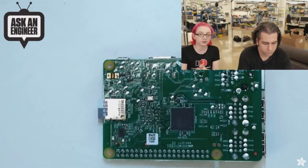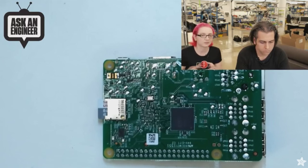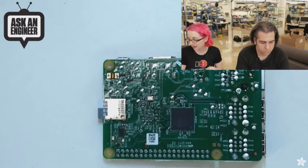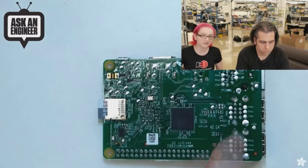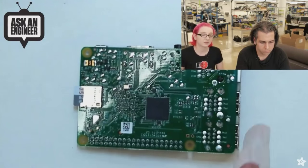It can do Bluetooth Low Energy. It can definitely do Wi-Fi, because I booted up, associated with the Wi-Fi, and loaded up Adafruit. I believe it also has Bluetooth Classic, because Matt Richardson posted a video of it doing audio. I think it can do Bluetooth Classic, Bluetooth Low Energy, and Wi-Fi. The Bluetooth support is still in progress, but Wi-Fi is definitely supported out of the box. That's really cool. And it uses SDIO, so you don't lose a USB port or an SPI port for it. It's basically built in.